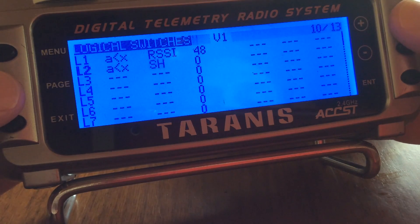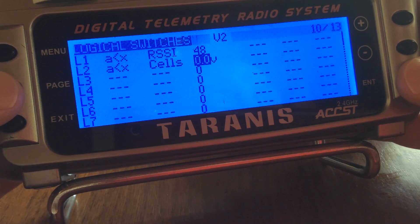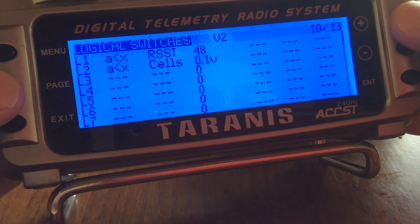What we're looking for is to display cells. That's all of the cells that are present in a pack, not just reading the individual cell. My interpretation is that cells is derived as a multiplier of cells, so it's probably not as accurate as your cell pack voltage but it is accurate on each individual cell. We've got cells here, and for the demonstration I've got a 3S pack, so let's set a value of around 12 volts because I know the unit is nowhere near 12 volts, and that'll give us the ability to have an audible alarm.